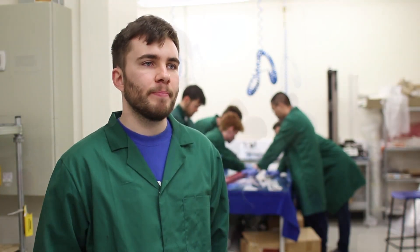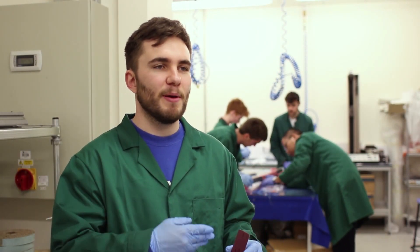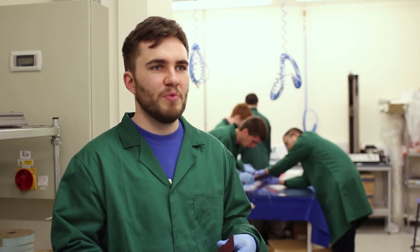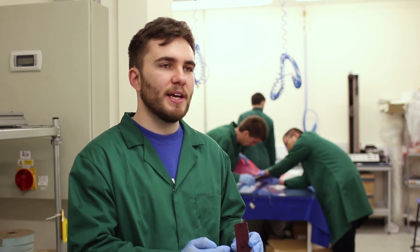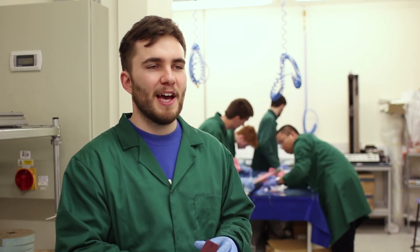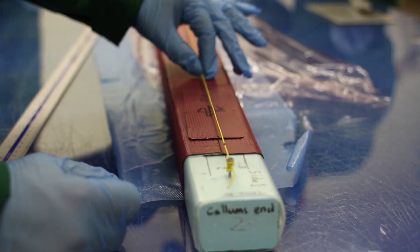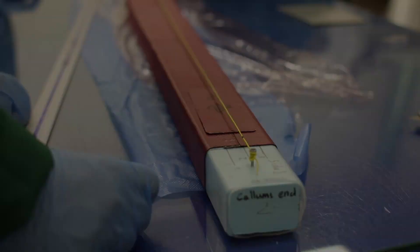So that not all of our joints are in one place on the beam. Because we've got pad-up plies in our lay-up we need to be able to accurately and repeatedly put them in the same place. So we've put these little cross marks onto the pad-ups and, as you can see behind me, the yellow piece of string, which will allow us to align them in a longitudinal direction.